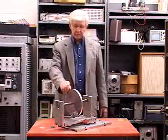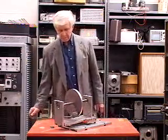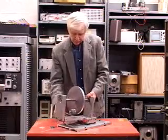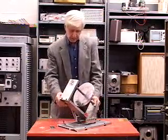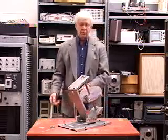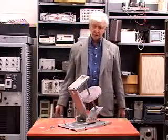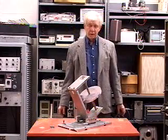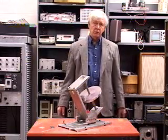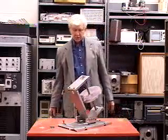The highest natural frequency occurs when the axis is horizontal, and as we increase the angle the frequency becomes lower. With a model like this the frequencies are so low that one can count them with a stopwatch and measure the frequency quite accurately — that's why this is such a useful model.